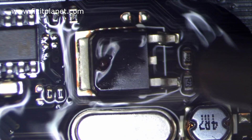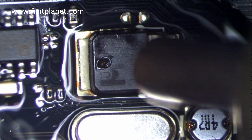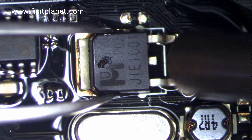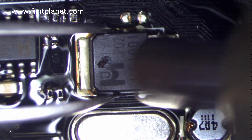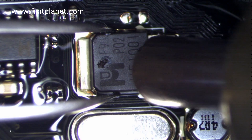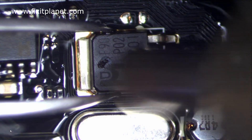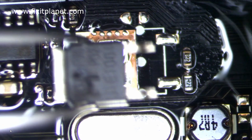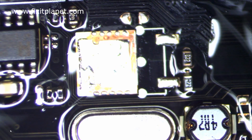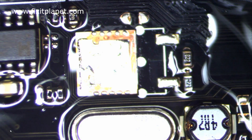These boards are actually cold because the air conditioning is on, and they took a little bit of time to get warmed up, so it does add a few minutes to the process. We're using a Hakko FR802 hot air station — we're at about 800, maybe 850 degrees — and I have the airflow set at about 15, maybe 20.